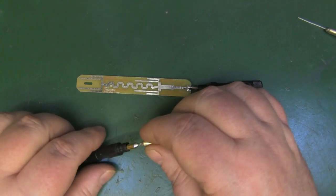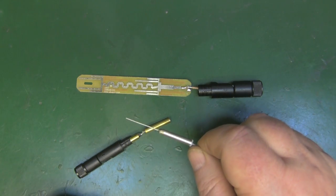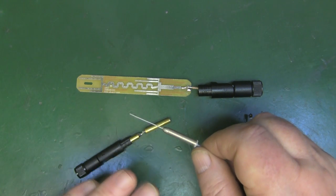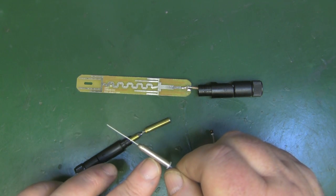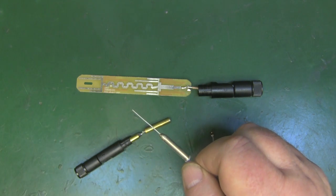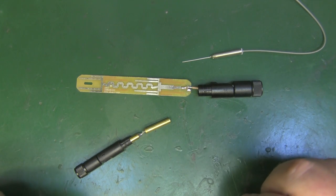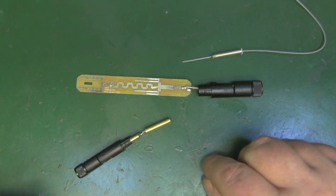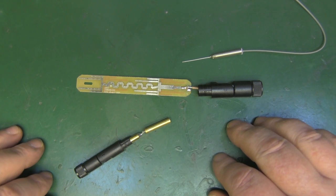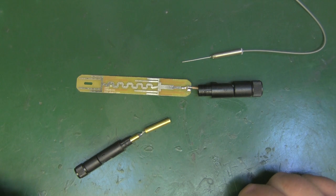An interesting note about hertzian dipole antennas: when I've done videos in the past, it's often ham radio operators who jump on and start calling these collinear antennas. I've shown collinear antennas for Wi-Fi in previous videos, but these are not collinear — they are hertzian dipoles. That's why the measurement is 25mm and still the center frequency for 2.4GHz rather than 31mm, because it is a capacitive design. It always seems to be ham radio guys calling this a collinear, and also saying the measurements are wrong — but they're not. It is a hertzian dipole antenna, and also the most popular Wi-Fi antenna in the world.